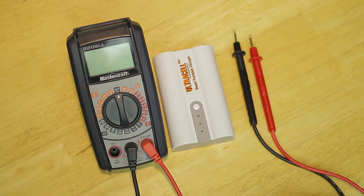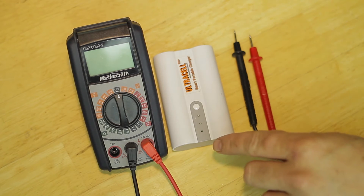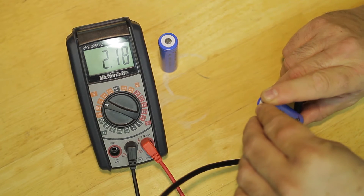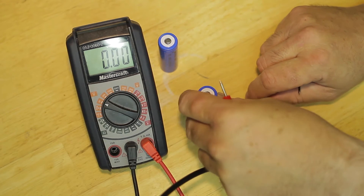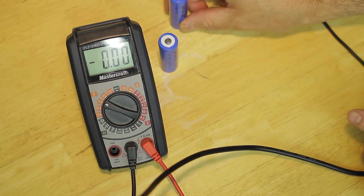For this test, I'm just going to be charging my 18650 batteries using the BioLite stove. So that one's reading 2.66 volts. The ultimate lowest you should really bring these batteries is two and a half volts. I pushed this battery — you really shouldn't go below three — but I might be able to get it charged up.